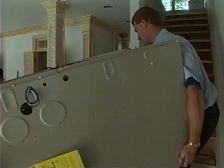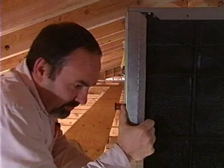The improper sizing of HVAC equipment is one of the most common problems in the design of HVAC systems. Studies show, on average, systems are oversized by as much as 55%, and that oversizing can reduce the actual SEER by 10% or more. It can be oversized by a ton to 2 tons and sometimes even more. Sometimes contractors think that bigger is better, and it's not. We want HVAC equipment to be right-sized. Right-sized equipment will provide comfort and energy efficiency for the homeowner, and the money we save we can use for other measures in the house.